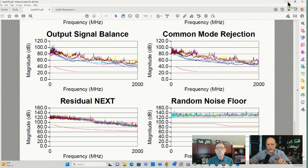Looking at this, it looks very similar to a regular cable test result. So as long as the squiggly lines don't touch or go below the baseline — winner, winner, chicken dinner, right? Exactly. And headroom — the more space you have between the plot and that limit line, the more headroom you've got, which is good. If it were to exceed that limit line, it would fail the calibration. DC resistance going out of spec will also fail it.